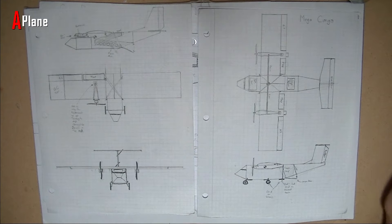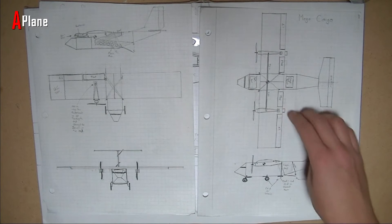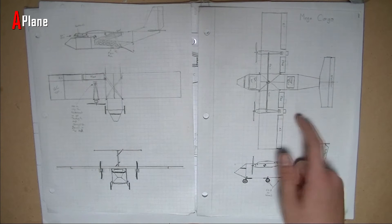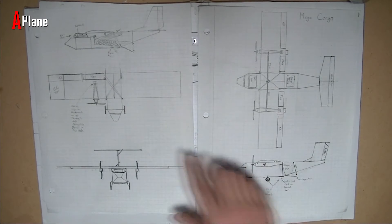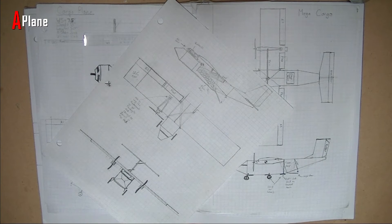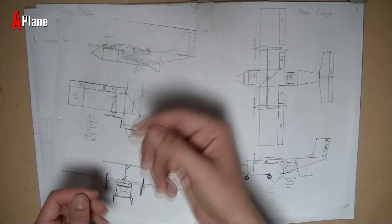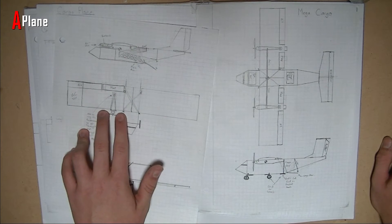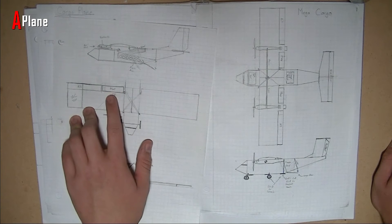As I was doing that I found that I would have to cut a big spot out for where the flaps and ailerons could be, to have the rubber bands go all the way across the wing onto the other side. And I didn't want to do that because I wanted to have pretty big flaps on this plane so I could fly pretty slowly. So I came up with the idea of actually having a hole in the wing, and having the rubber bands go into it and actually hooked onto a wooden dowel that's inside of the pod, not on the outsides. Those rubber bands would stay on the inside and then you just wrap them up through the wing and over it onto the front two that would stick out on the front of the pod. That would hold it in and then you could still have the flap as a full span in the back without interruption.